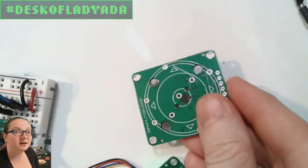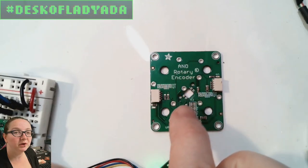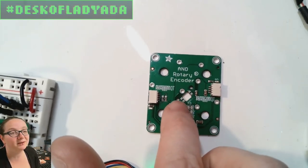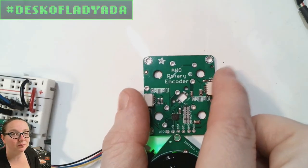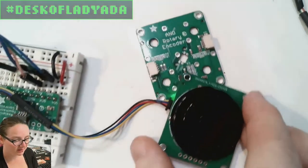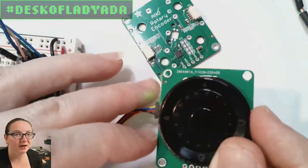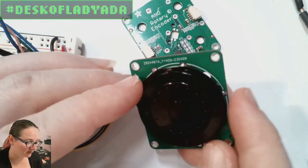So this is the design for the PCB, and you see there's the holes for the rotary encoder. This is the ATtiny816. There's a slot here for the NeoPixel, but I didn't solder it, and I'll show you why. I did for one, and then I'll show you why I didn't for the others. And then STEMMA QT. Normally, I like to have the STEMMA QT centered, but because of the weird hole locations for the encoder, you can't. And then this is the final built version where it has the NeoPixel. So the NeoPixel, I thought, might shine through, but it totally doesn't at all. It's extremely opaque. So I'm just going to remove it because it would have been cool to have.